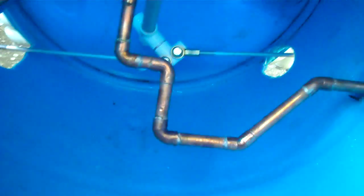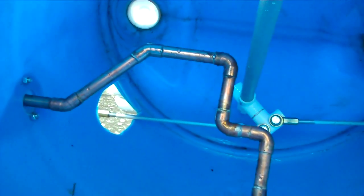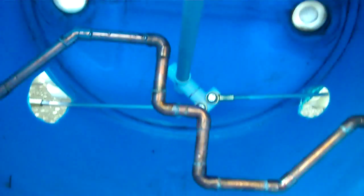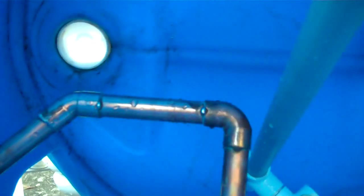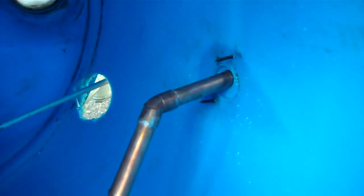Here's another nice feature of this little car. The problem with the earlier one was making the crank. This little crank is fabricated out of hard copper, which means you just cut the pieces to length, put the elbows together, and run a little solder in each joint with your butane torch and there you go.